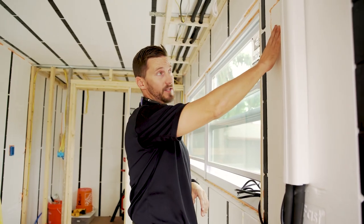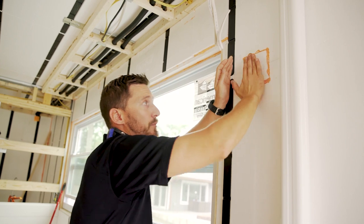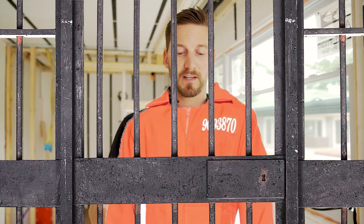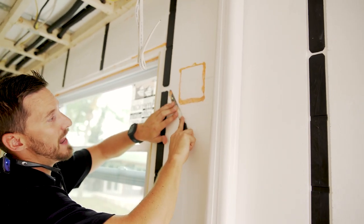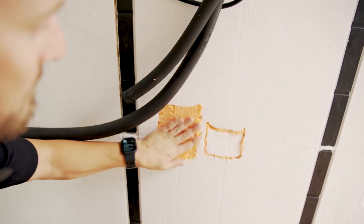When you do cut these holes where you need to, if you shave down the foam a little bit, they actually go back in nice. I spray foamed the hole and put the same chunk right back in and pushed it in tight. I also used what I call the InSoFast shank — honestly the best tool if you're doing InSoFast. It's just a long metal sawzall blade with electrical tape as a handle. I lay it flat so it bends slightly and cut it off nice and smooth.